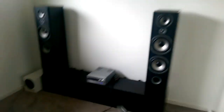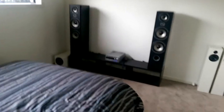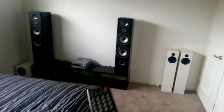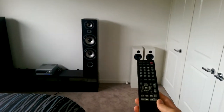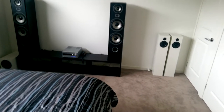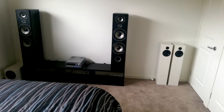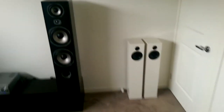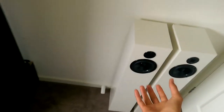The treble needed to be more present. And the bass really didn't sound like two 8-inch drivers. On a flat frequency response they actually have more bass than I expected. The bass isn't too bad after a closer listen, but the magnet on the 5-inch mid-range driver probably has more motor force than both of those 8-inch woofers combined.